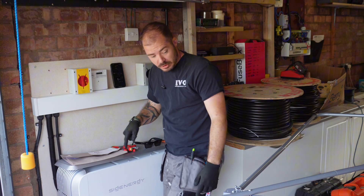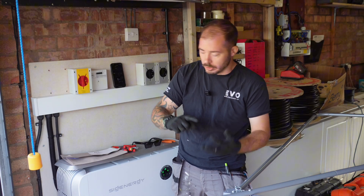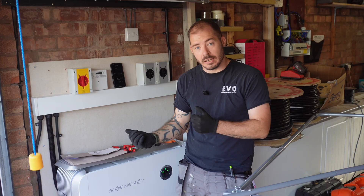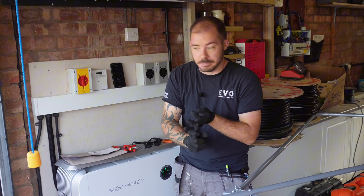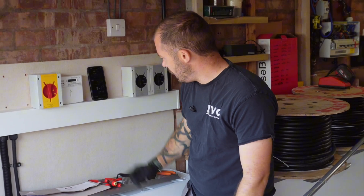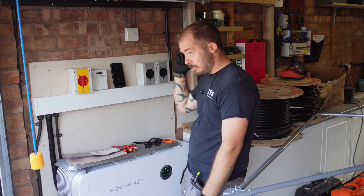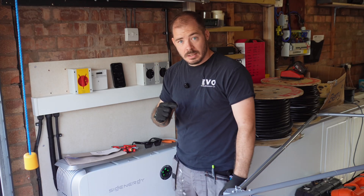That is the SIG Energy — all commissioned. One of the things I love about the SIG Energy is it literally takes minutes to commission; it's not like some of the other systems out there which are a nightmare. You need to read the technical notes — five minutes, commissioned, does a self-check, tests everything — very straightforward. It's connected to Wi-Fi but we also insert the data dongle so if the customer loses Wi-Fi it's got the cellular connection as well. Right now we're producing 2.1 kilowatts — it's a bit overcast. 1.5 kilowatts is going into the battery and 600 watts is going to the house. There is a washing machine on so that's changing dynamically. All I've got to do now is label a few things up, do some paperwork, test sheets, get rid of all this rubbish back into the van — and that is possibly Saturday reclaimed.